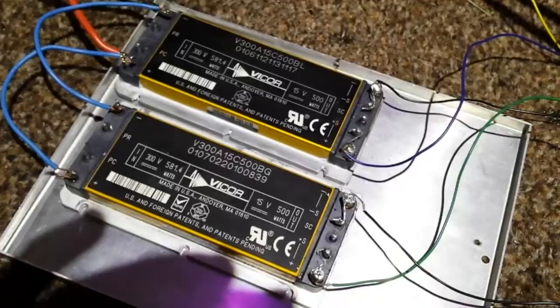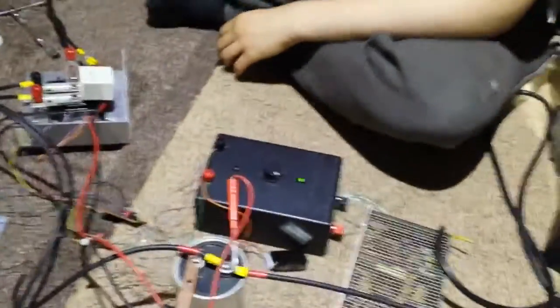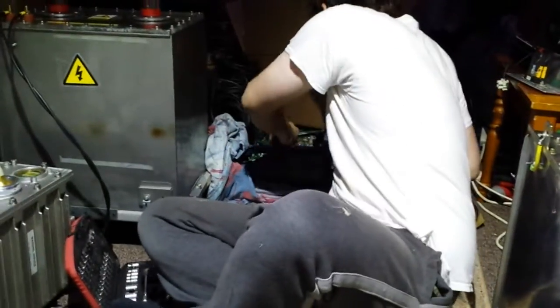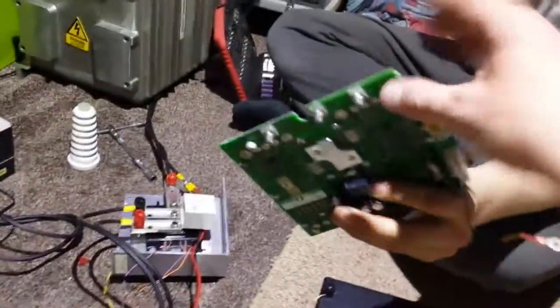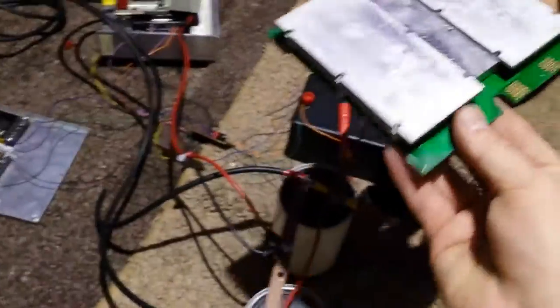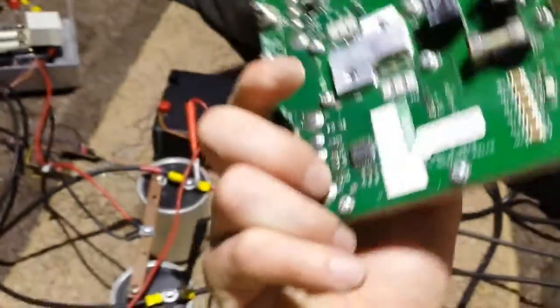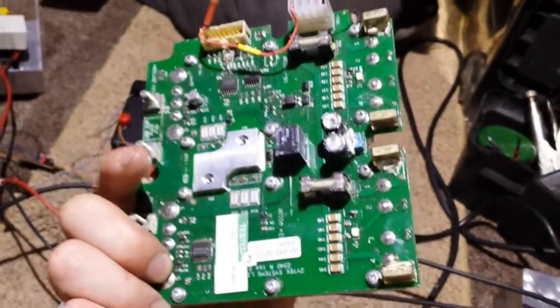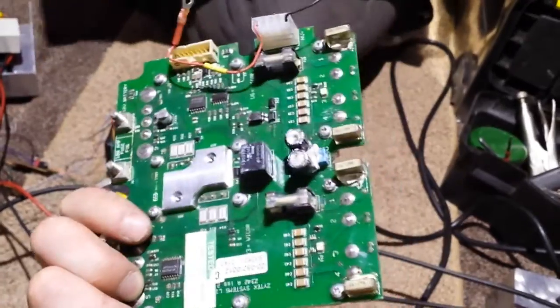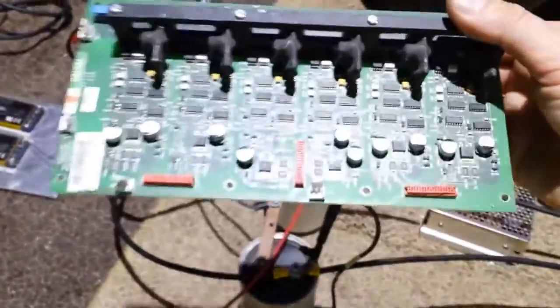The guy said to me I can just take them, because we'd spent quite a bit on the other stuff we'd bought - the IGBTs. This is one of the boards guys - this is the underneath of them and that's the top. We could have actually used these themselves but we didn't have the connectors, and a lot of the surface mount components were missing because they'd been thrown around. These are the gate drives we've built - but those scrapyard ones are a bit more advanced, they can put a bit more current through it.